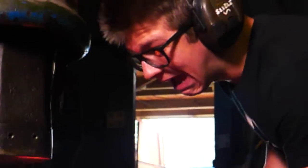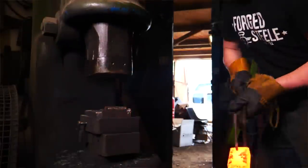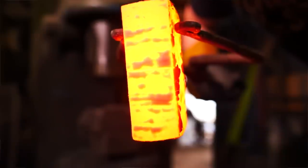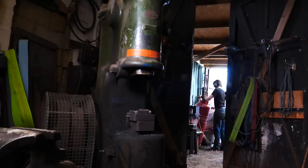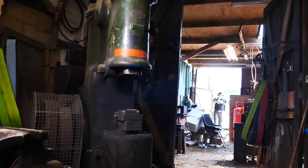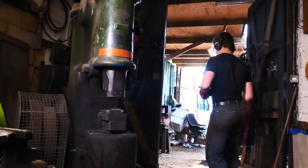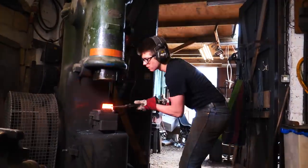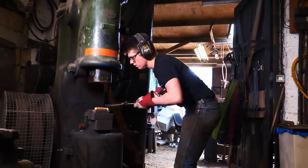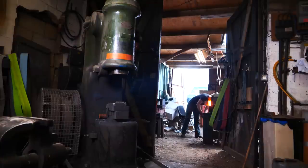This is where there was a problem. As I forged it, on the sides, a crack opened up on every single weld line. This was trouble. So I left you here and we're fast forwarding the rest because I've been pulling my hair out for the last 30 minutes trying to get these welds to take. This consisted of forge welding again, fluxing, forge welding, grinding out cracks, forge welding some more, drawing it out, forge welding, drawing it out, checking it back, putting it back together. Eventually I have two pieces that don't have cracks and are forged to 16mm thick, 45mm wide.